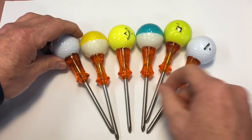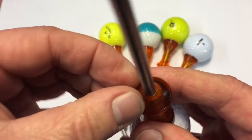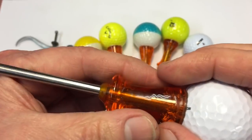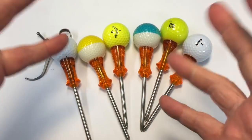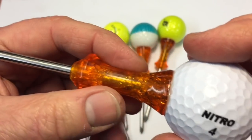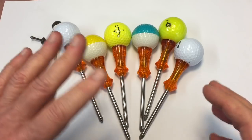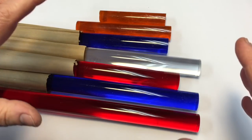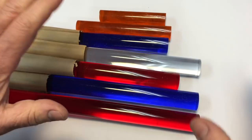The only difference between this prototype and the other ones is that I made the tip — where the screwdriver comes out — it's really tight, almost like a press fit. So there's less area inside for it to maybe expand, it's so tight. Maybe it's off-gassing and that's what's creating the crazing. So if anybody here has ever seen that before, or if you used a different kind of epoxy or glue, I'd appreciate any thoughts or experiences you might have with crazing in acrylic.